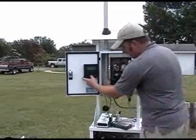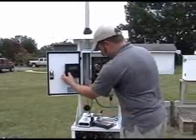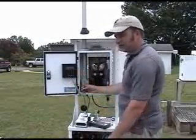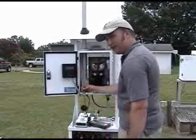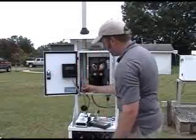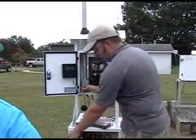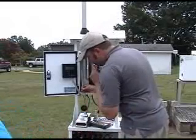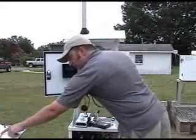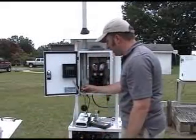I need to hit space to calibrate and then punch in my reference value of 32.4. You have the opportunity to put a minus sign in with F1 or change units from Celsius to Fahrenheit with F2. That's the uncalibrated sample temperature. Entering 32.4 and hitting enter gives me a new raw and offset. The raw is 1579 — the raw number is a voltage in millivolts. The offset is 54.